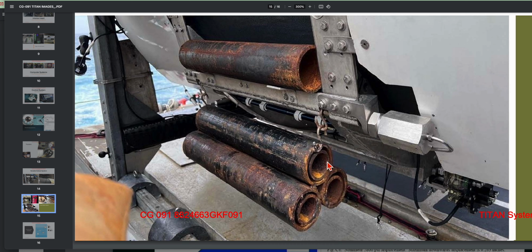Steel tube here, tack weld and tack weld and tack weld, combining one set right there. I think the intent of this clip here is if you roll the vessel, rock it and roll it, this will roll off in case your drop weight system doesn't work. You can rock the vessel, as presented in another video where somebody said they had to rock it to get the weights off. That would rock that off. Of course, it would probably hit here and hit the skid on its way out, unless you get lucky when you rock it, it's on an inclination that lets you clear this when it falls free. That's a thought for you.